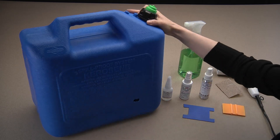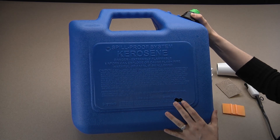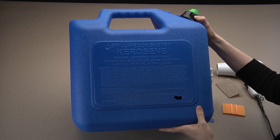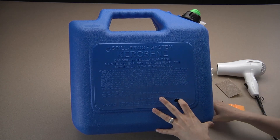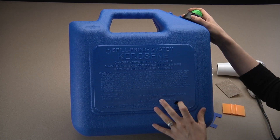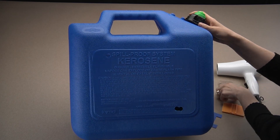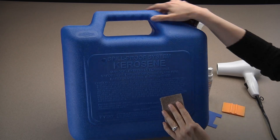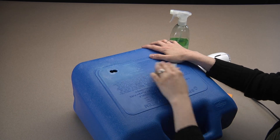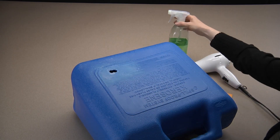The first step is always surface preparation. For repairing a hole, you need to rough the area around the hole to remove dirt, grease and any other residue. If there is a 1-inch hole, the S patch needs to be at least 2 inches wide. So you need to rough at least the same amount of area as the size of the patch. We are going to be using 60-grit sandpaper. Once finished, clean the roughed surface with any cleaner that won't leave a residue.